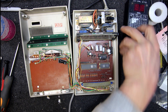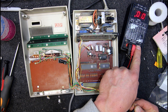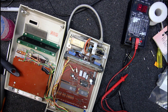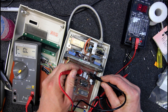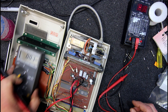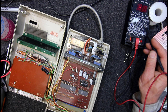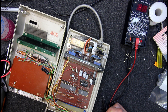I guess we should have a look at those capacitors. That one's looking like the plastic's a bit back on it, like when they shrink when they're hot. It's a 100 volt at 10 microfarad. I probably should actually check that doesn't have any voltage in it, because that's probably some of the high voltage stuff. We've got 3 volts — I'll take a risk and short them out a bit. 2.1, 2.0, that's a 10 microfarad at high voltage. 250 volt reads 2.5, so it still rates better — should read about 3 on the ESR meter.